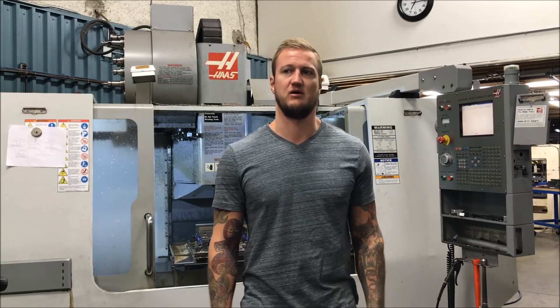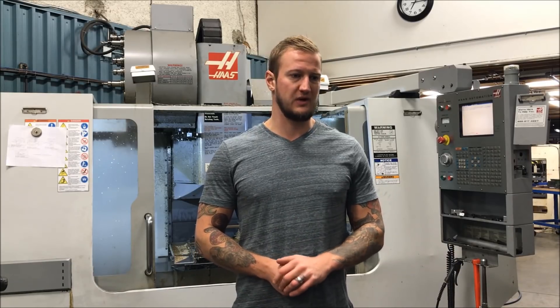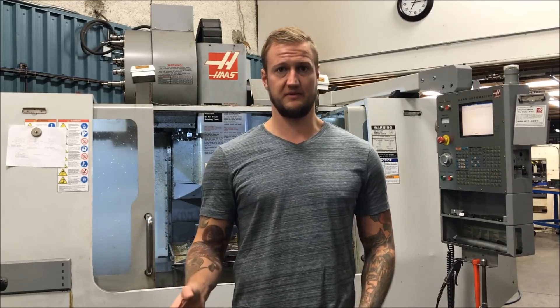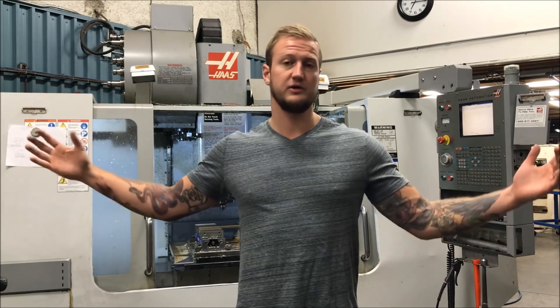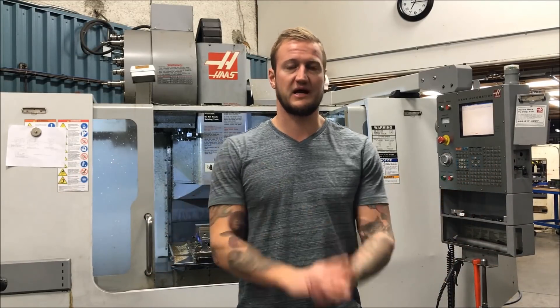That's how we're going to mill some long brass profiles inside the Haas Automation VF5. There are a couple of other profiles we're going to do — I'm not going to film them all. This is a pretty standard thing we do a lot here at Lakewood; we do a lot of long brass and bronze profiles. If you want to take the chatter out, I do a lot of spring passes because that's just how I like to get a finish anyway — the cuts are so light at the bottom that chatter doesn't really matter. The solution for chatter when doing something like this is either to have a long fixture you strap-clamp your piece down to, or move your vices closer together to hold it at more spots for more rigidity — though that's something you have to do based on feel.